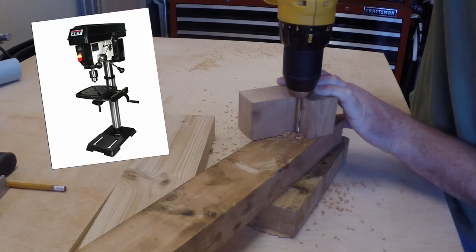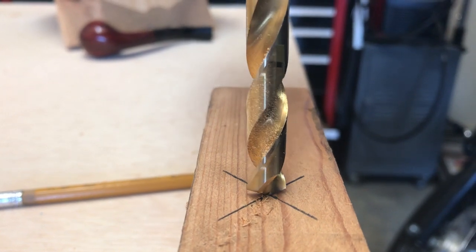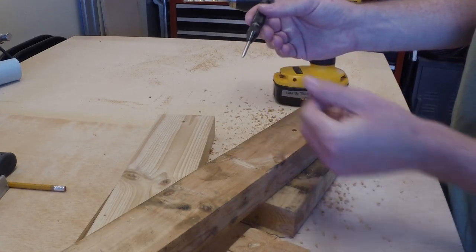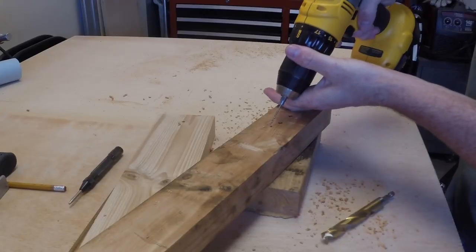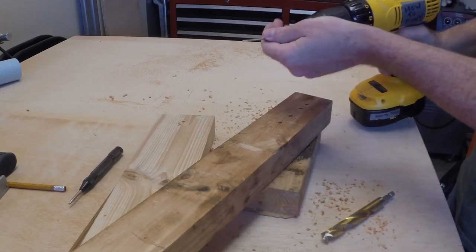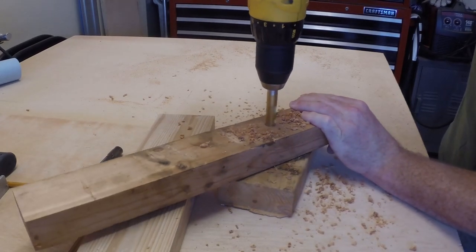You could also splurge and get yourself a drill press to solve this issue, but personally I'm too broke. Another common problem is your drill bit wandering before it even starts cutting into the wood. One way to help is to use a scratch awl or center punch to make a small divot to give your drill bit's head a place to rest before it starts cutting. With larger drill bits, you can also start your hole with a small bit first, then drill with the larger bit using the small hole as a guide — this also helps prevent the wood from splitting.